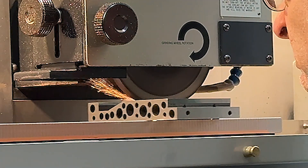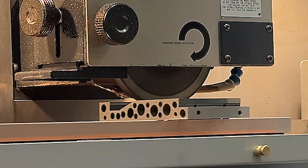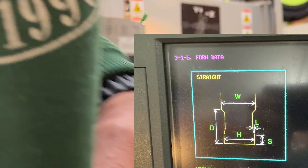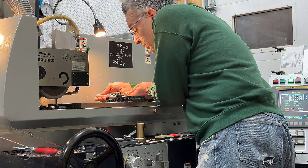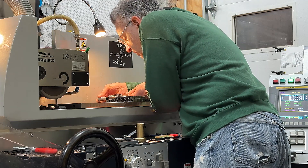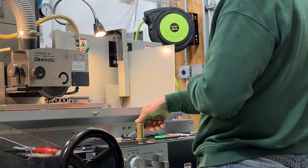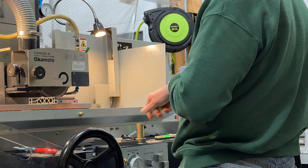There's the sparks — more than I would have liked to have seen. We're side wheeling and we have formed that wheel for this job. You can tell by looking at the grinding wheel and you see that little dark rim — that's indicative of the shape we've put on the wheel. At this point I'm checking the dimension of that back rail on the part and storing it in the micrometer, now in incremental mode so that when we go back to measure it, we can measure material removed.